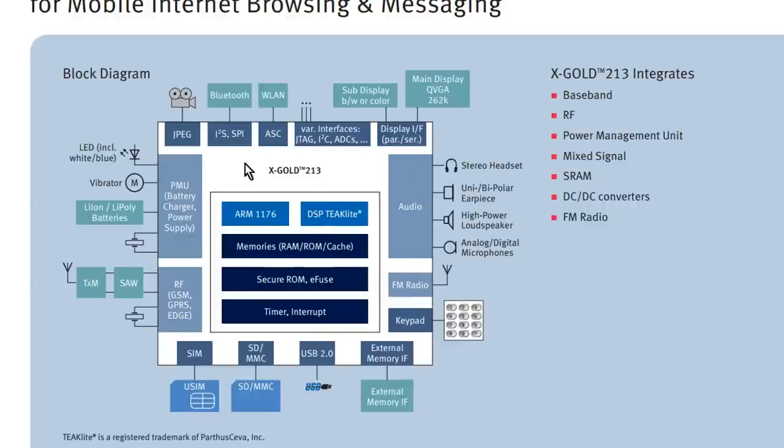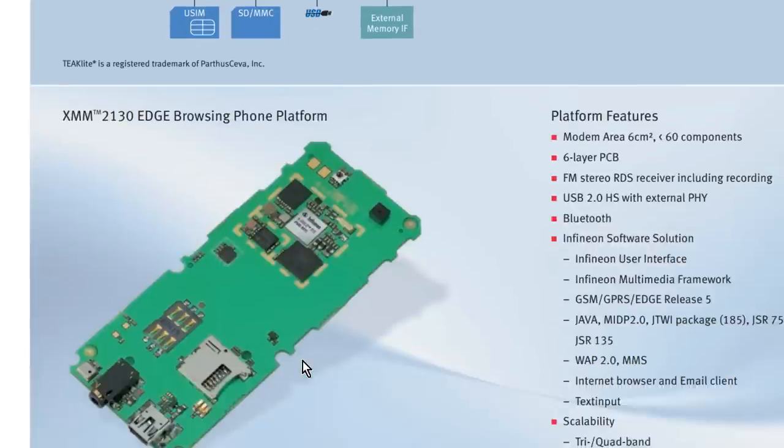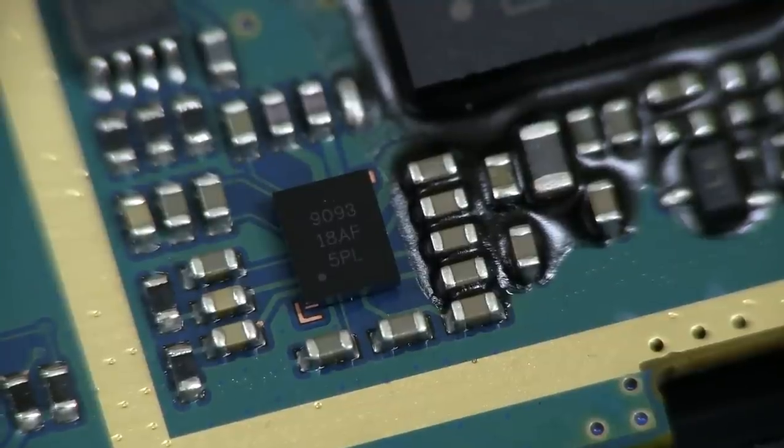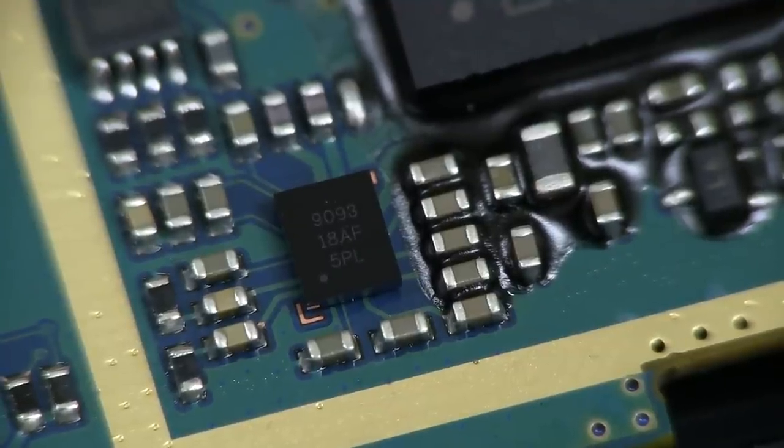What I didn't see here is a touch screen controller — I didn't see mention of that. So we might need an external touch screen controller, perhaps. Over here next to our transmitter, we've got our SAW filter block — external. So maybe that's what was inside that can we saw over here. It drives the vibration motor directly, handles all the lithium ion and lithium polymer charging, everything else — it's got the microphone inputs direct. Fantastic. Another tiny little BGA device down in there, lots of caps hanging off it. Not exactly sure what that one's doing at all. Likewise for that one — KSRBR? No idea.